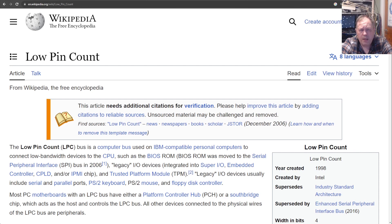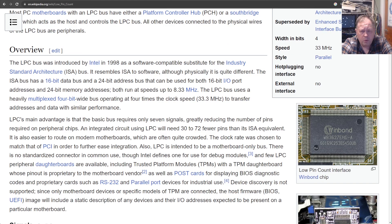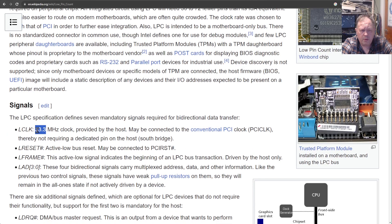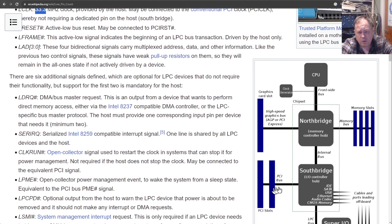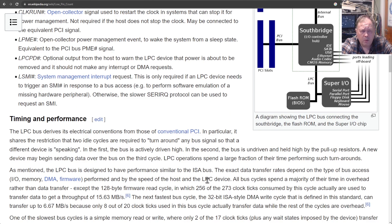On some modern motherboards, a lot of this functionality is coupled to USB ports and USB hubs instead of the ISA bus — things like PS/2 keyboard functionality. This article is a good read for anyone wanting in-depth knowledge of what this is. The clock is 33.3 MHz, though many implementations use 25 MHz. They also have some graphics of how this is connected, though not for our specific implementation.